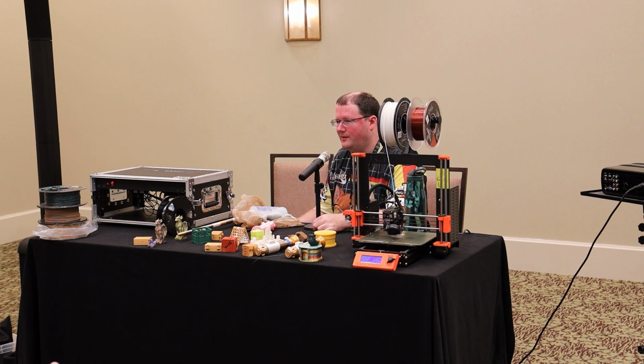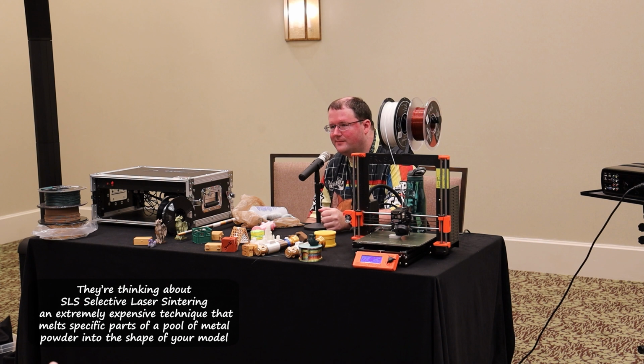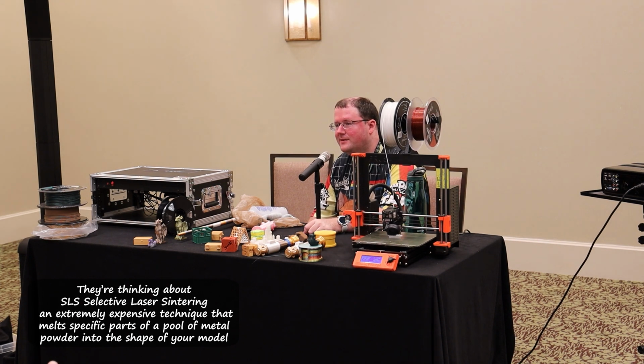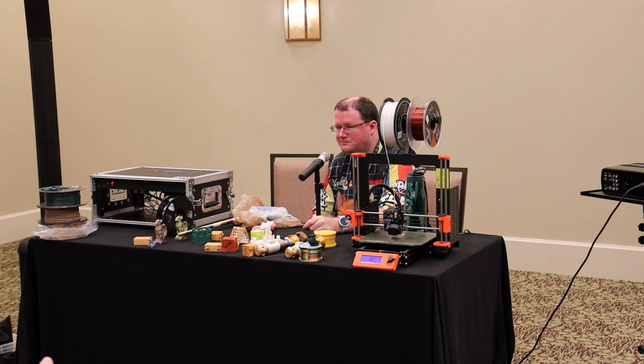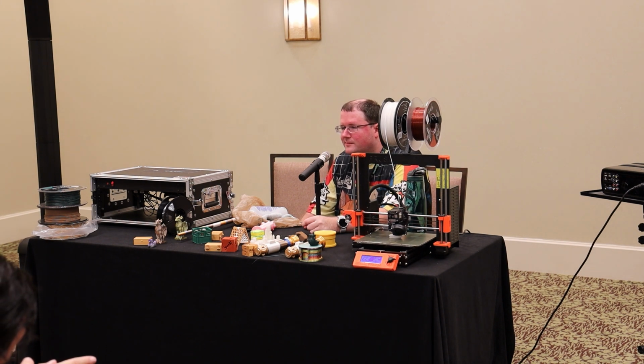So it uses, correct me if I'm wrong, a laser basically to... No. What it is, it's an array of UV lights, usually LEDs, run through a diffuser and then up to an LCD panel. The LCD panel blacks out the parts that you don't want to harden, and leaves clear the parts you do. The resin is UV reactive, so once it's exposed to UV light, it hardens within anywhere from 3 to 10 seconds, depending on the formula for the resin. And then it's layer by layer.